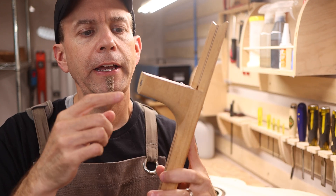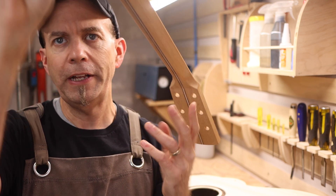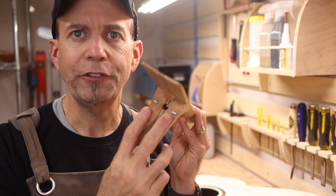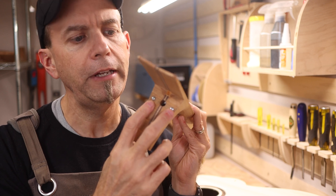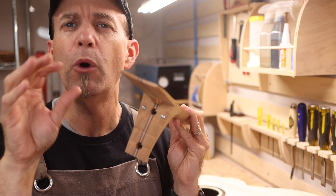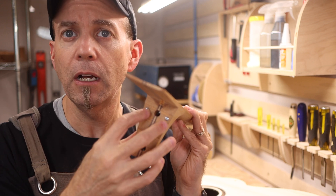In the neck we have seated that round rod. It has been threaded with two holes in the end for us to feed both of the anchor bolts into. In addition to that, you see the two little screw heads here — those are tiny screws that are going to fit and rest inside of those grub screw heads, and that becomes the pivot point.